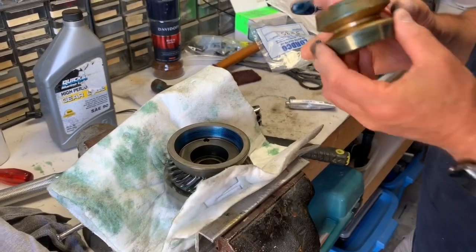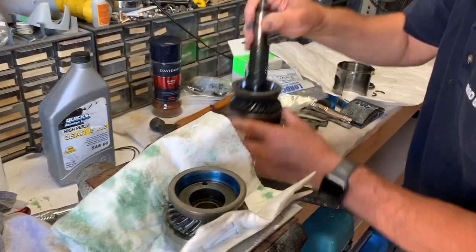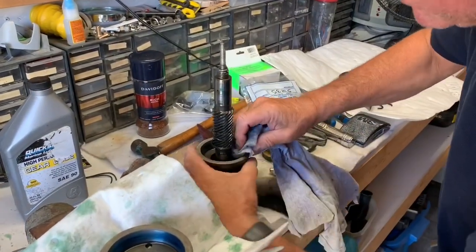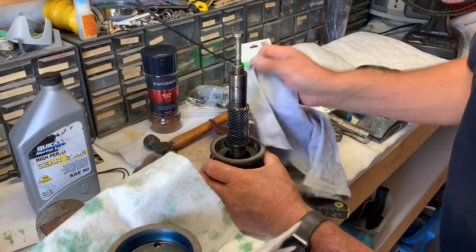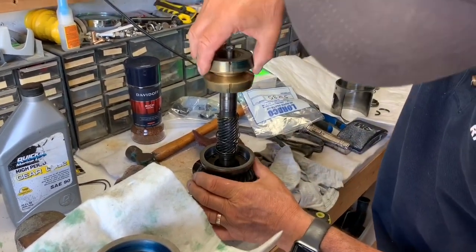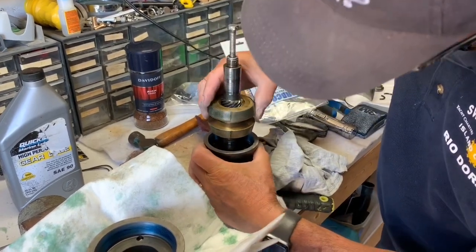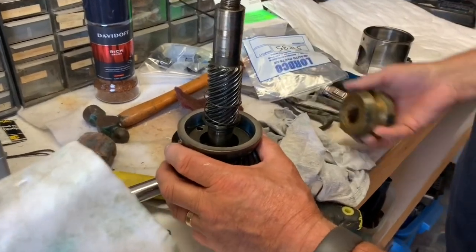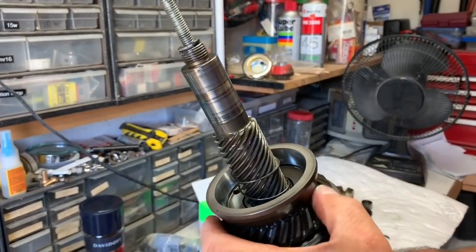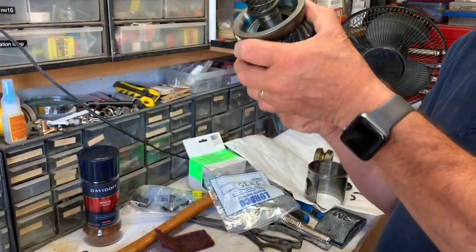It's telling me a story. And if I take that same thing now, it tells me there's contact everywhere. I clean all the oil off the surface first — there's no oil on the surface. That's a very narrow tolerance now. I'll take this and lap those two into each other. Look at it — do you see where it's touching? Not everywhere. Poor lap job.